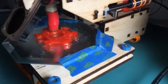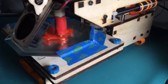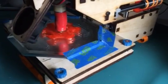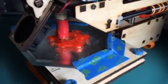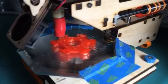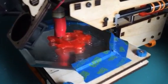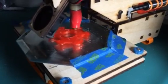How do you pronounce it? It's German — I don't speak German. So, this effector will have the carbon fiber rods attached to it and it will hold the E3D hot end. It will have the auto bed leveling probe attached and hanging out the side. I'm going to use Ian Lee's design for an E3D hot end, and then his design for the attachment to mount the auto leveling probe.